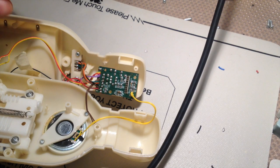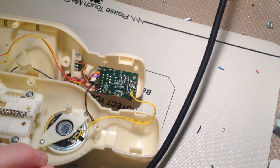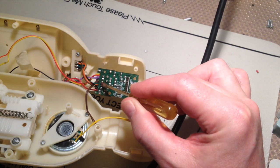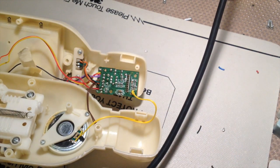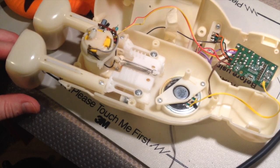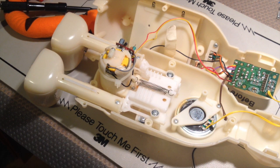I've checked out the power coming from the battery and there seems to be plenty of voltage there, and all the other connectors look fine. One of the things I did notice is that he has a connector in his hand which is broken off. I've traced the wires back and they come back to these two ground wires here. I've traced them through the other side of the board, and if it is that switch then it should be a simple matter of just making a joint across here in order to get him to fire up again. The good news is he's fixable — it turns out to be a simple matter of a snapped wire in his arm.